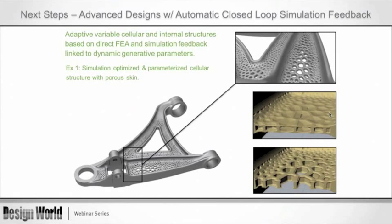We were talking earlier that we wanted to do a third control arm, and this is more of a conservative route because we needed to finish our project, to be honest, and we are still modeling what we're calling the blue sky design. We designed small I-beams and spread them throughout the control arm, and as you can tell, we've only grown them in certain areas. Where we didn't need as much supportive material, we left the cellular structure large and thin. Where we needed it stronger and to control the weight going into the different control points, we grew it at a more dense rate.